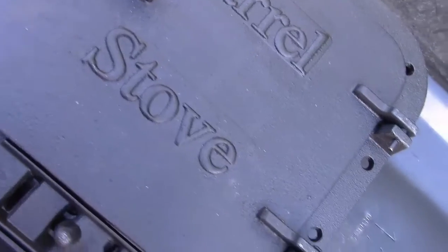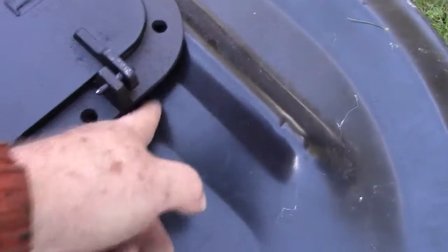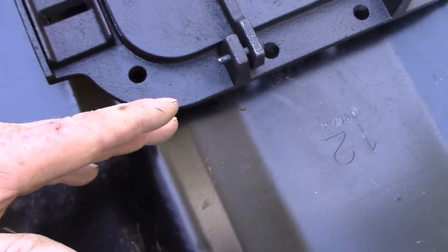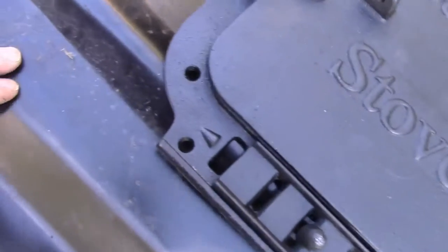I've got one or two choices here. I can actually just bolt into the top one and not have to worry about it. Look, that's just a bar. So if I was to bolt there onto the top one and bolt right into that lip, I just have to concern myself with the sides and the bottom. So if I slice this, and slice that, then I can take a piece of L-bracket — the angle iron — cut it and slide that down into the slice, making this flat here. Then I just have to weld this and this, and whatever it doesn't close in, I can just put some weld in it. Do the same thing on this side.